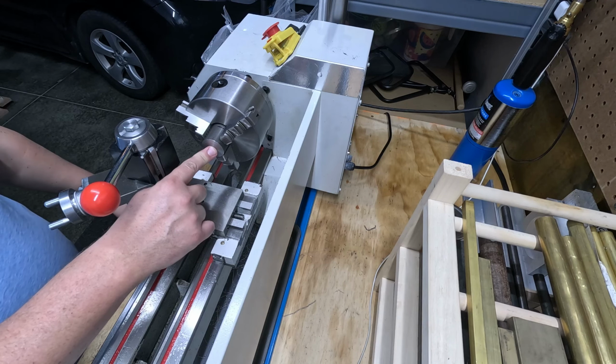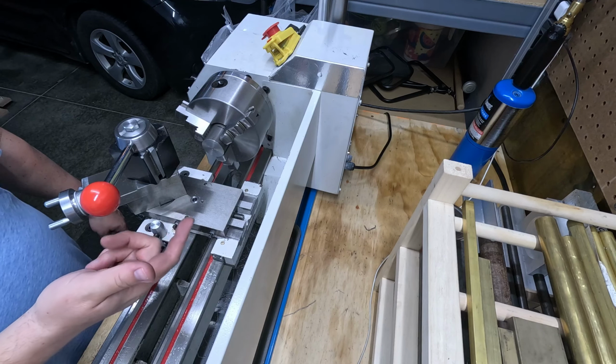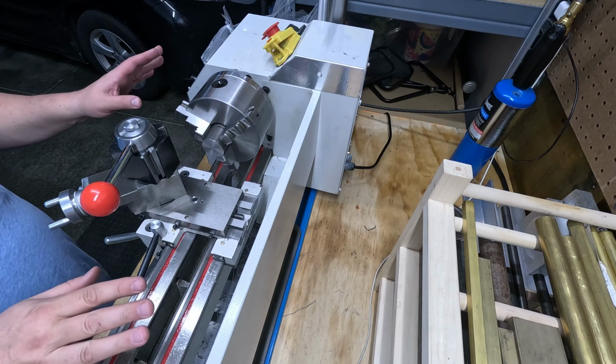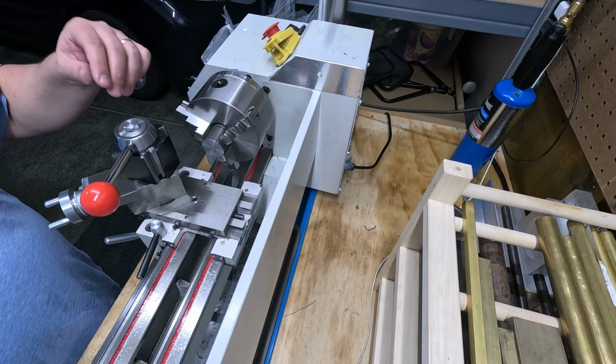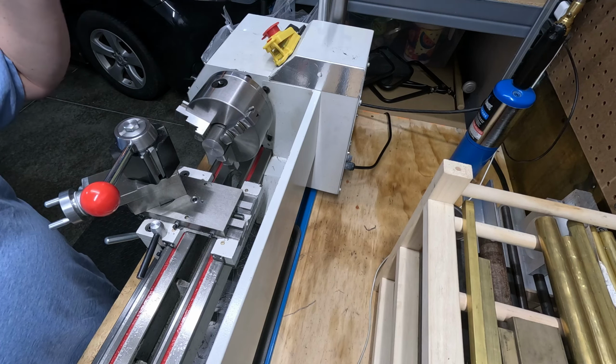We're going to do a center drill, and then what we'll do is drill it. We're only going to go in about an inch and a 1/4, and that's good enough. And then that'll take care of the hole, which we will then tap, and we'll test our screw and make sure that stuff's working, and then we'll get on to the finished dimensions of the outside portion of this.